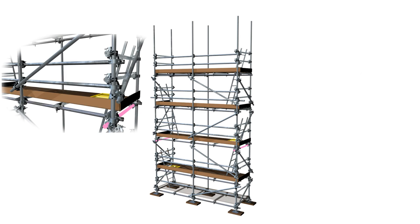Scaffolding lifts are enclosed with edge protection to prevent operatives and materials falling from the platforms. The edge protection comprises guardrails, usually formed from scaffold tubes, and toe boards, which are usually scaffold boards set on edge between the decking and standards at boarded lifts. The edge protection may be supplemented by other means depending on the nature of the works.